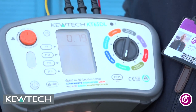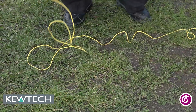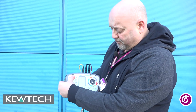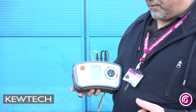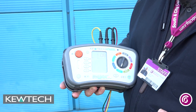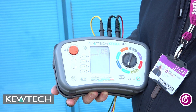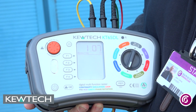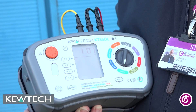What we do now is our second reading. We simply take out our temporary spike P2 — potential two — place it in the ground, and take our second reading to guidance note 3. As you can see, it's slightly increased because it's gone further away, and we've got a value of 1.07. Let it stabilise — that's my second reading.